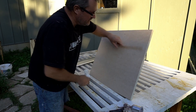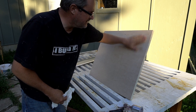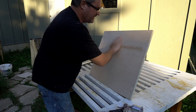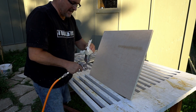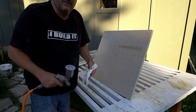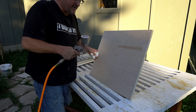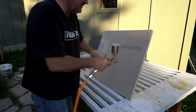Looking at this, I can see that some of it did get on there before it started to flare up. I think what it was is that it's too thick. So I thinned it down about 50% — I added lacquer thinner to it — and I'm going to try it again. I already sprayed it on the ground and it still webs up. But I think if I hold it in close, it will actually go on the wood.